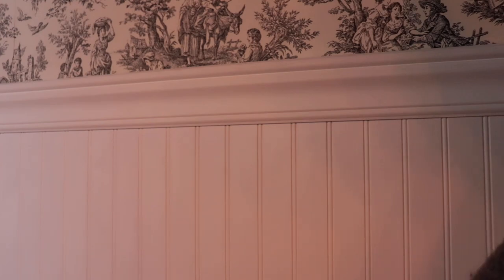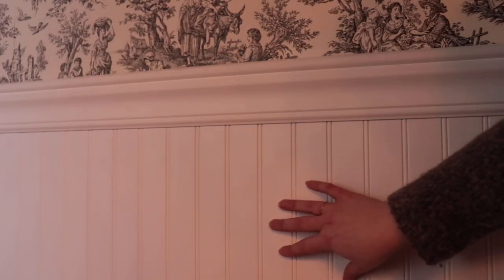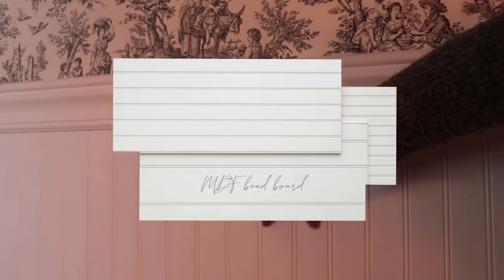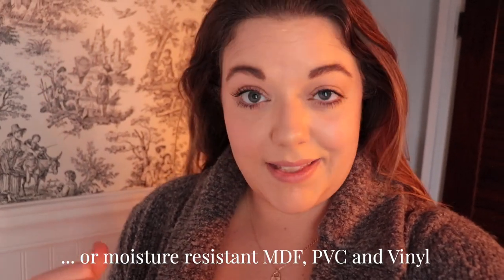Wainscoting is when a portion of the bottom part of the wall is covered in either paneling or some sort of wood detail or tile. This goes up to just about chest height on me. This is called beadboard. There are different widths of beadboard that you can get — this is pretty standard, and there's one that's about three inches, which is also really standard. This beadboard is MDF, as well as the matching chair rail and baseboard that go with it. Now if you're going to be using beadboard in any areas that are pretty moisture-prone, like a bathroom, don't use MDF because MDF is basically mold food. This bathroom does not have a shower — it's just a half bath — so it's okay in here. But if you were going to do beadboard in a full bath with a shower and a lot of moisture, I would stick with wood beadboard, not MDF.